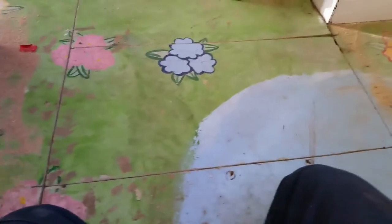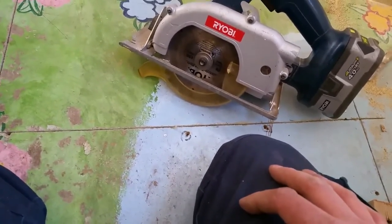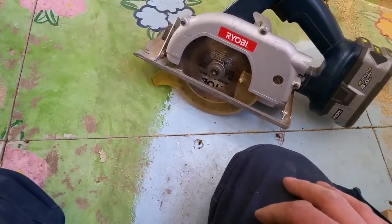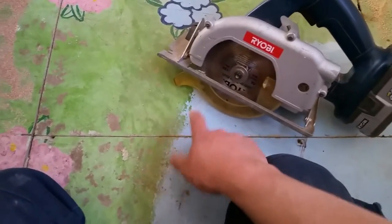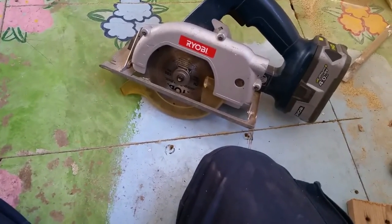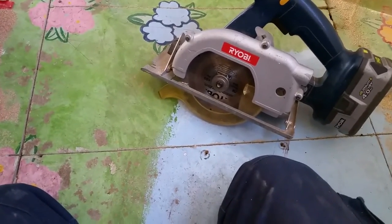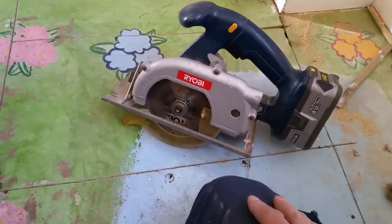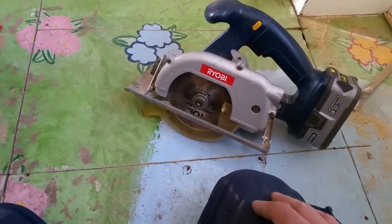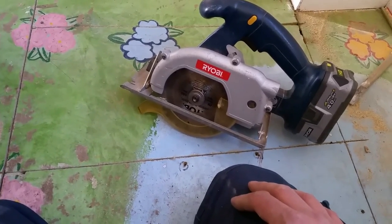I would say I do prefer lifting floorboards. This stuff is horrible, especially when you can't find the nails. And when using a circular saw, always set it to the correct depth. You never know if you're going to have pipes or wires at the top end of the joist. So always set it to just under the depth of one of these, which is about 18 mil. You never know, you might become unlucky if you were to go all the way through. As it was, I did know that the cabling was that way, and we have no plumbing upstairs at all, so I wouldn't expect to hit any pipes. But just for argument's sake, I had that on the end in case anyone goes chopping through pipes. Yeah, move the lighting point.